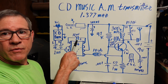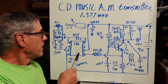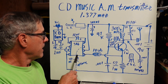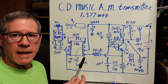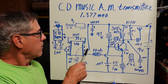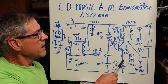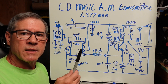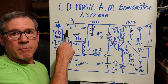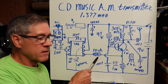I have pins 2 and 4 grounded. On pins 1 and 8 I have a 10 microfarad capacitor to increase the gain. This runs on 9 volts, which powers the 386. Optionally you can add a capacitor to pin 7, which makes it extremely loud, but too much amplitude causes distortion — I think I only use that on the FM version. The output of the 386 is pin 5, which goes through a 10 micro-henry choke. That resists current flow and really helps this circuit.